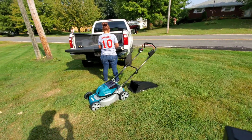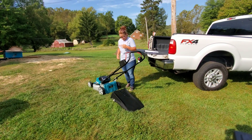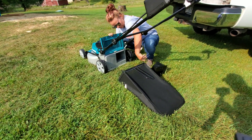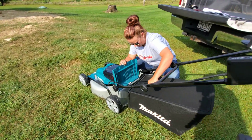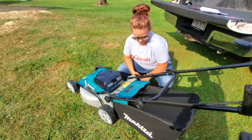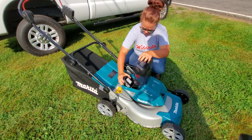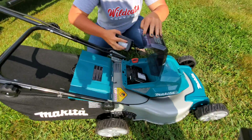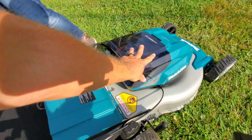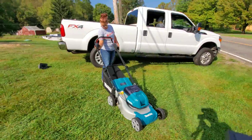So TQ just showed you how the mulching kit works — now we're going to go ahead and show you how the bagging system attaches. This may be a little tricky. We're going to remove the mulching kit — you definitely have to remove that or you're not going to bag anything. Take the bag — there's little hooks on each side. Stick it up in there, hook it, make sure it's hooked, then just let that rest. I wish this stayed up on its own, but you actually have to hold it. Something they can make a little improvement on next time. All of your compartments are covered up out of the rain, so you shouldn't have to worry about that.